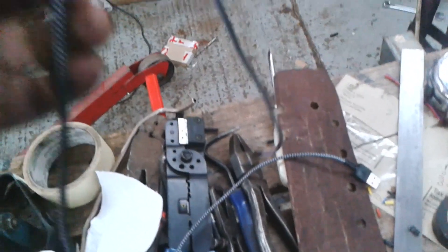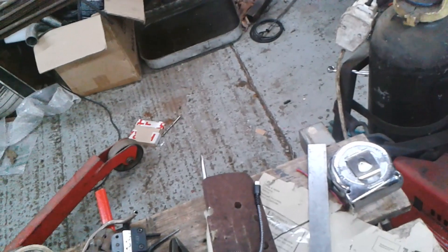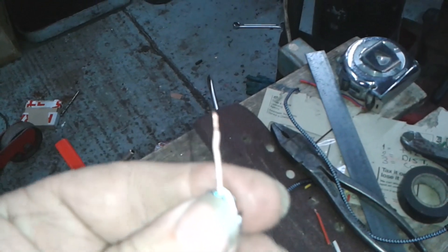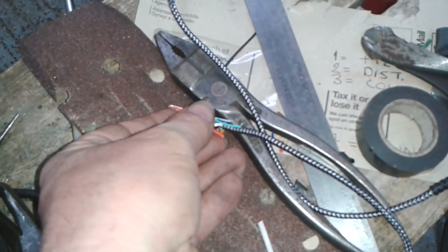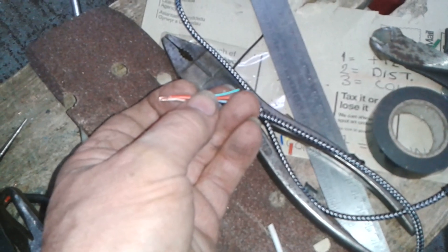Here on my table is a USB lead and I've just put it in the car and measured it — I want it to be about as long as where my finger is, so I'm going to shorten it around about there. I've bared the wires back and exposed the pink wire. What I've done, I've cut those three off at different lengths so if I just bind them they're not going to touch each other. That's a very thin wire, so what I think I'm going to do is get this bit of wire, crimp them together and then just bind that there so that it stiffens the end up a bit.